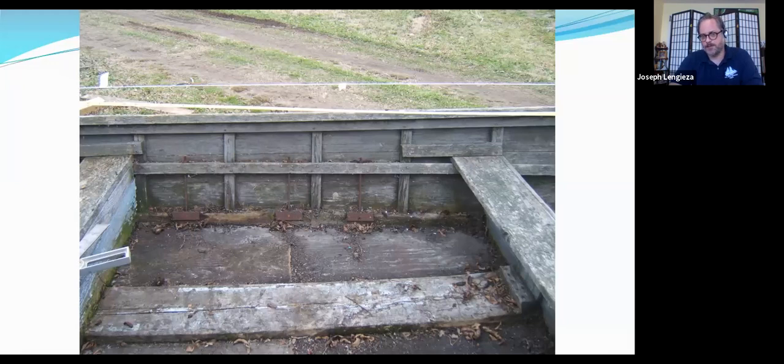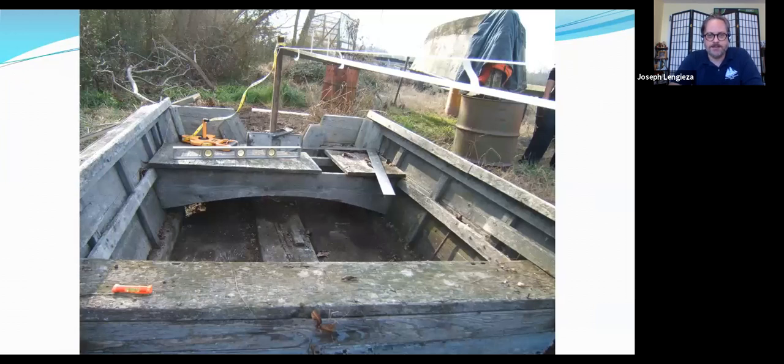This example has a plywood bottom. So just a couple of sheets of 4x8 standard plywood. It's got that interior keel, or keelson, that's added on afterwards as a stiffener, and a couple of seats. And you can see in the stern here, looking aft, there are two stern posts, or transom posts would probably be the most precise term. But in the massive timber in the corner, there is a main structural element that's tying everything together.